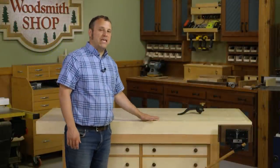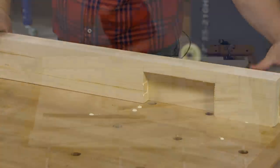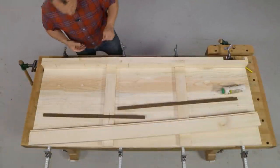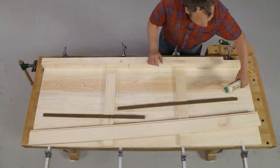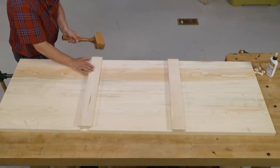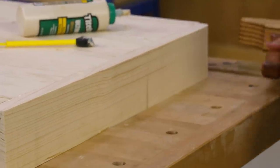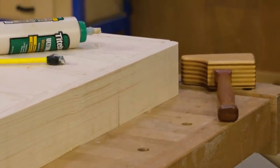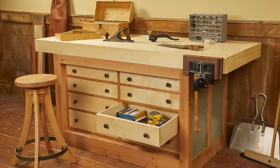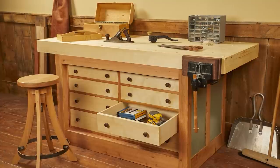Finally, we'll wrap things up with making the solid wood top. It serves a bunch of purposes. Along the front is a thick, stout assembly where a lot of the heavy work will take place. Towards the back and middle is a wide panel, and I'm going to add some sliding taper dovetail cleats in there to strengthen everything. The back and ends have a frame-and-panel look that helps hold everything together and give it rigidity. All in all, it's a great bench and a fun design, and I hope you'll learn something about woodworking as you build your own version.